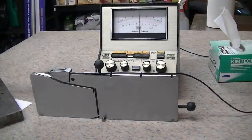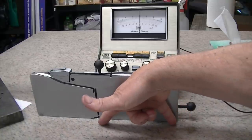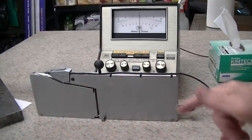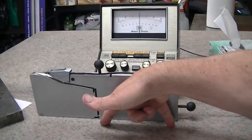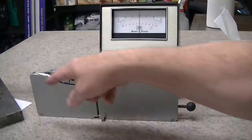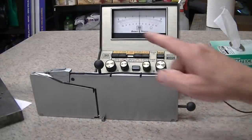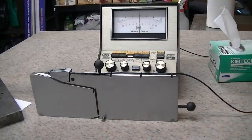As has been mentioned before, a repeatometer cannot in itself measure the flatness of a plate. It can only measure the repeat reading ability of the plate. That means relative to these two feet, the plane formed by those, what's the rise and fall of this foot out here? That represents the equivalent of a surface gauge or some kind of measuring instrument base relative to where it's measuring. As you drive around and measure that same measurement in different places on the plate, you would get that variation in reading. That would be the repeat reading. So they can't measure flatness, they can only measure uniformity of sphericity.